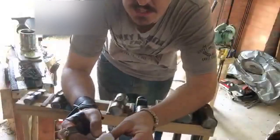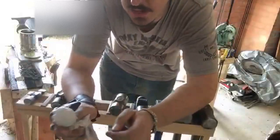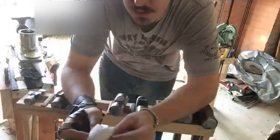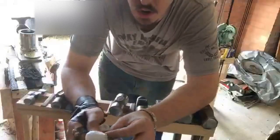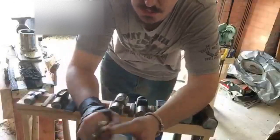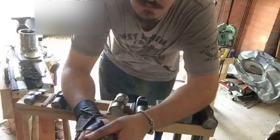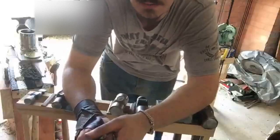Now, for those who haven't seen a linseed oil finish before, you don't want the steel to be at a red heat. You want it to be just before that. So you want it to still be black, but hot as hell. There are ideal temperature ranges and things, but really, if it's a black heat and you'd seriously burn yourself if you touched it, that's good enough.